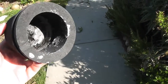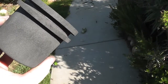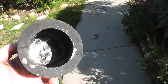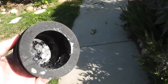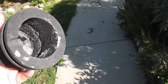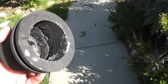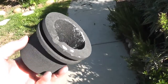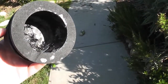So real quick, before we get the furnace going, I wanted to show you the crucible that goes into the furnace. This crucible here is made out of graphite, I believe. And in the bottom, if you can see that shiny material, that's melted borax. You use that to season the crucible so that the gold doesn't stick to it, and helps the gold stick to itself and helps you get it out and refine it a little bit. I'm still learning about this process of how to melt and refine gold. But so far I really like using borax because it's a very straightforward process and it doesn't involve harsh chemicals such as mercury or cyanide that are dangerous and environmentally impactful. Borax is something that you use around the house, and I'm pretty comfortable with that.